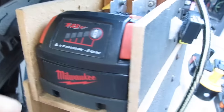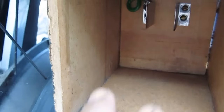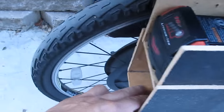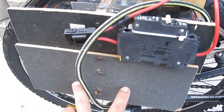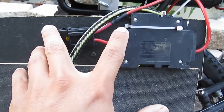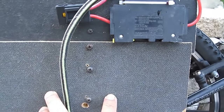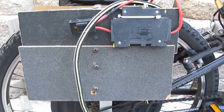Down here I made the same thing — the same sliding bracket setup, two brackets on this side going to two brackets on the other side. So I can install two more batteries — one on this side, one on the other side — connected in series. Then this bottom pair, connected in series, is connected in parallel with the top pair. So the top produces 36 volts, the bottom also produces 36 volts, and they are connected in parallel to double the amperage, or the capacity, of the battery pack.